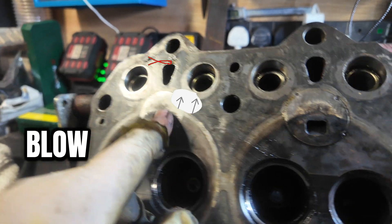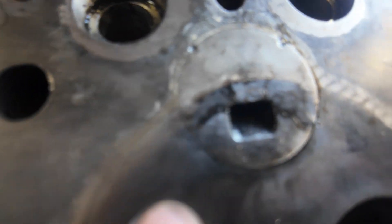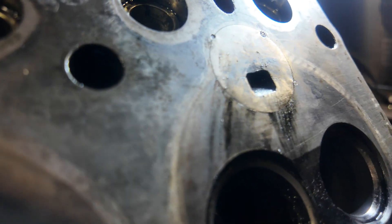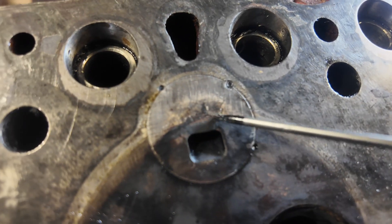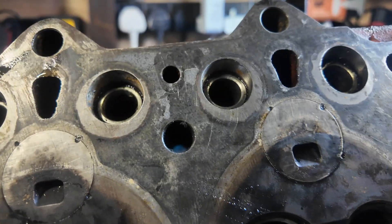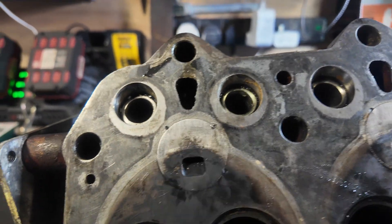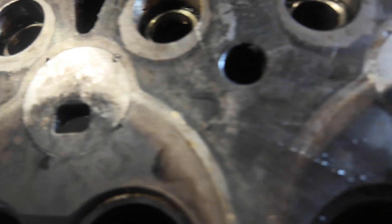Once the diesel and air mixture has been burned off, the fourth stroke expels all products of combustion in the form of smoke. If you see a crack in the hot plug — which you can just see one there — and you can get your thumbnail in it, then you punch it out from the top and replace it with another one. However, these are slightly cracked but not what I'd say are completely gone, so I think I'll leave these.